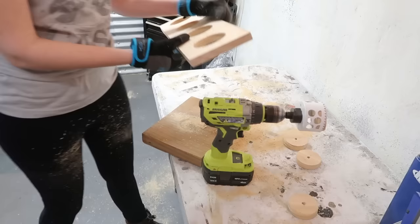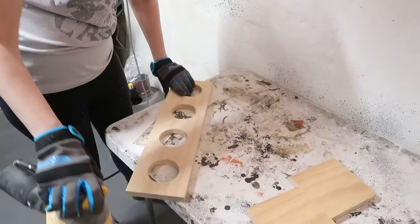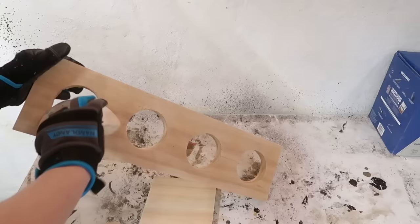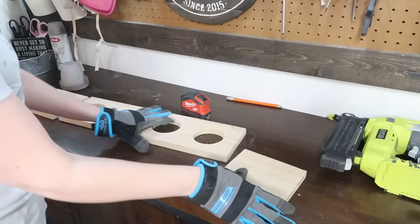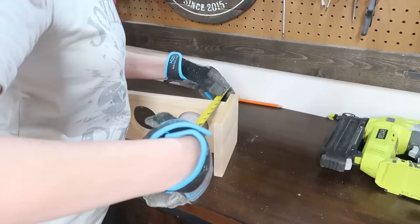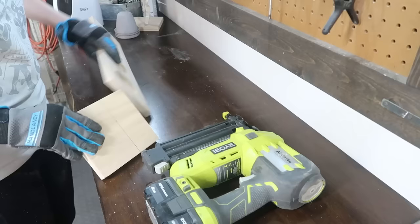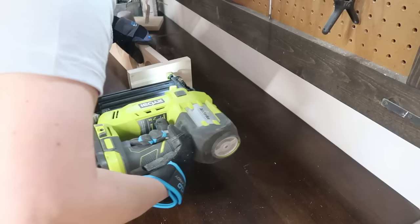With all four holes cut, this is looking pretty cool already. Now go ahead and sand everything down smooth to get all the splinters off. I'm using an orbital sander and 80-grit sandpaper to do the front, back, sides, and ends. You can also just use regular sandpaper and hand sand everything if you don't have an electric sander — you'll need to do that anyway to get the insides of those holes smooth too. To put this all together, we're going to use a brad nailer and one-and-a-quarter-inch brad nails. I measured down two-and-a-quarter inches from the top of the board and marked a straight line to help line things up on the side so we don't shoot nails blindly and have them sticking out of the wood.